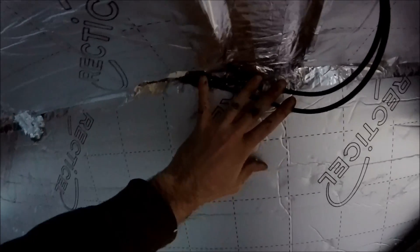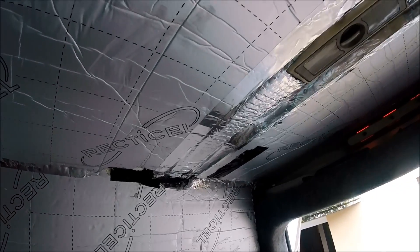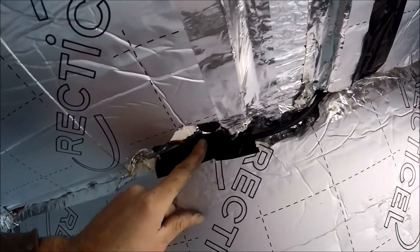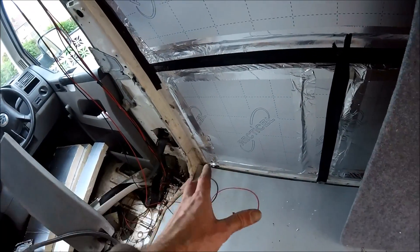There's plenty of cable that's come through the roof line, which is going to get tucked under the headlining. There'll be a join with a choc block connector, then I'm just going to feed the cable running all the way along and down to the main junction area where the solar controller, charger, and battery bank will all be. I've just finished routing the cabling — I've made a small cut in the roof insulation so the cable coming through the roof can sit pretty much flush. The heavy duty cabling runs along behind and then joins into the rest of the loom, which will be tucked behind the seat belt covers, with the fuse box and battery box down at the bottom.